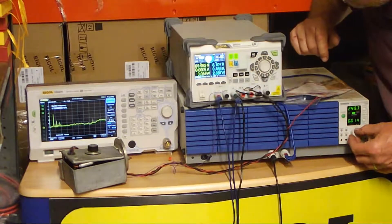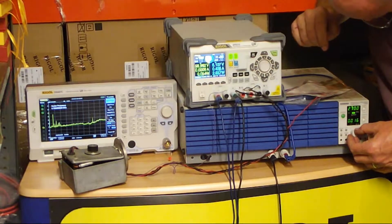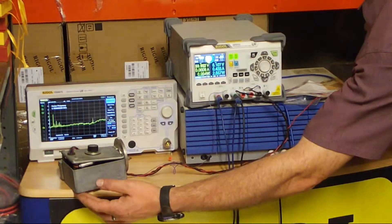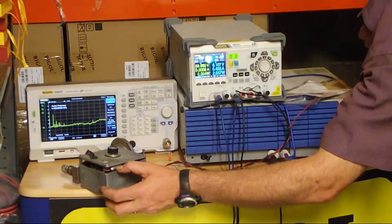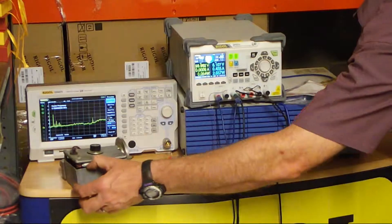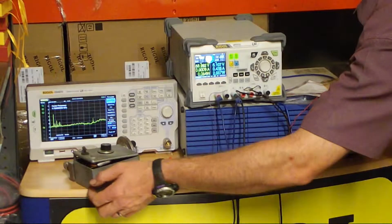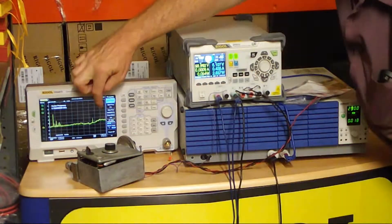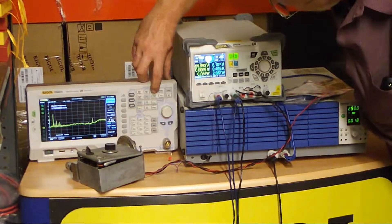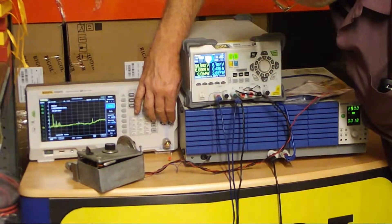Can you see that coming up? There it is. 250, 260, 270, 280, 290. Let's try just moving that waveguide a little bit — I'll just prove to you that it is actually that peak. It's probably reflecting off a few of the devices nearby, but this is a really nice little peak. Let's add a marker and quickly work out where that frequency is.